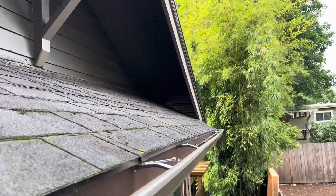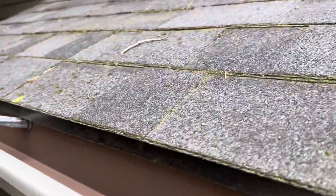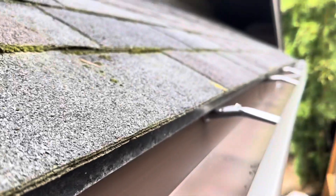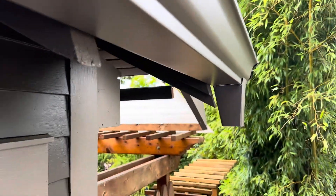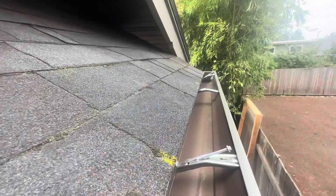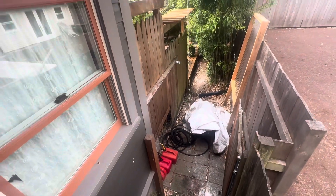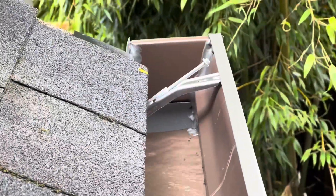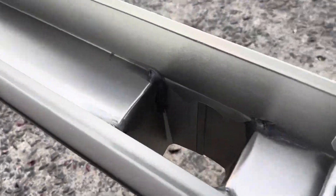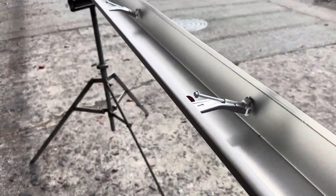Getting this gutter installed on the side of the house — it turned out really nice. We're going to water test it. Max flow outlet, end brackets every two feet, internal brackets with extra-long screws. Adding water now — we're going to see where this water ends up. It should come out right from here. There goes the water dropping out. Water test successful, running really good. That outlet is massive — big outlet. There's the gutter, one long piece, super-size outlet, no more clogs. These are really long screws, putting them at every rafter tail.